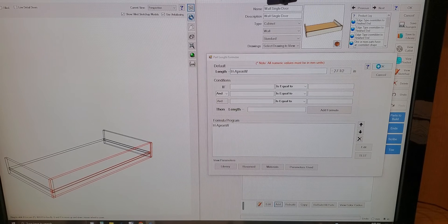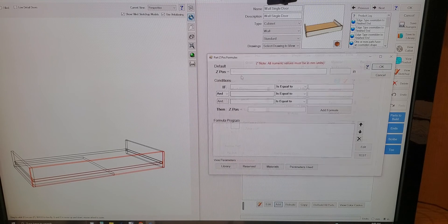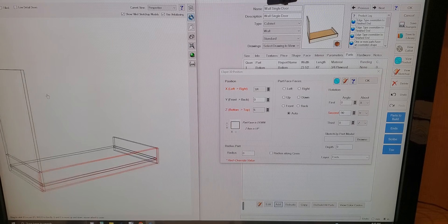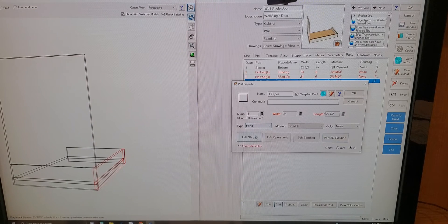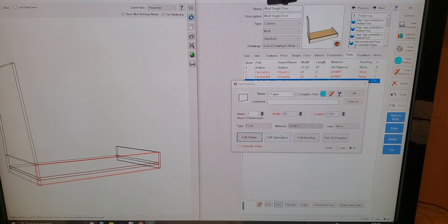For the 3D position, I'm going to switch this layer to ends. Bottom to top is going to be 'apron_W'. Left to right: finished_end.th is our parameter for the thickness of the finished end. I think it's Y no, minus 90. So then I have my side that's going to be tapered — I'm just going to adjust the shape of it so I can wrap my head around it. I click this front corner, and our Y is going to be 'front_taper' — that gives me that shape.